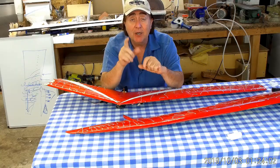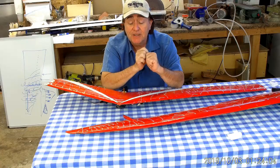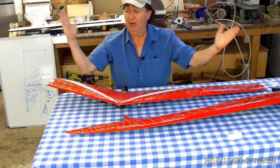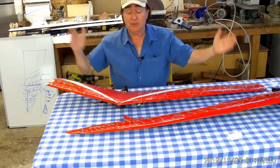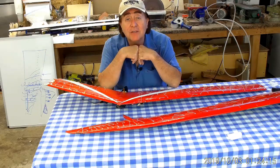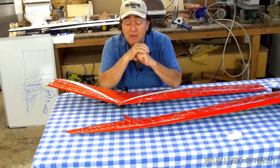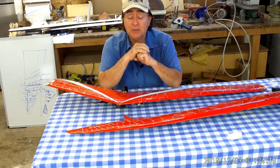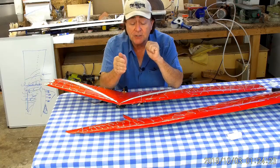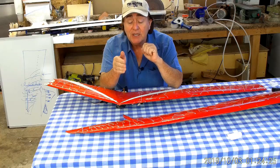This concept just seems logical: I've got rudders, I want as much moment arm as I can get, so I'm going to put them all the way out at the tip. Well, they're not helping relative to the stall-spin problem at all. You're better to move them inboard, use them as a fence in addition to being rudders.